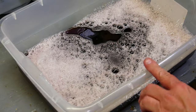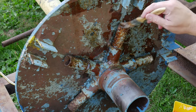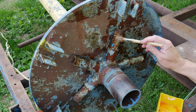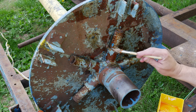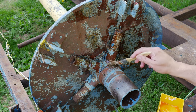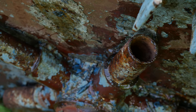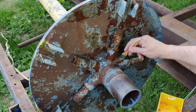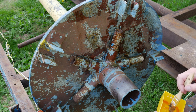I hoped I was going to be soaking the big main bearing, but that's not going to happen tonight. These are the stubs that the sweeps slide onto, and to me they look like they are paper thin, so I want to replace them. I don't know if this is an inserted piece or if this is just turned down from this, or exactly what we are looking for. I'm thinking that I may cut these off flush and just make a piece that goes in place, maybe even a solid piece. But I want to get the paint off and see if I can see any sign of a seam line between these two pieces. I'm assuming there are two pieces, but I don't know that for a fact — most of the other assumptions I've made about this ride have been wrong. I don't want to just cut it off without at least trying to investigate what's going on. I don't want to get into a situation I can't recover from.